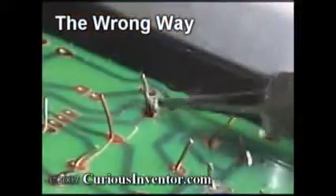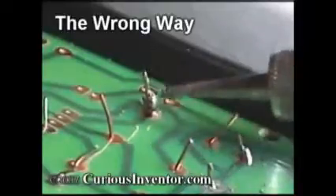Why isn't the solder clinging to the joint? Two reasons. Solder won't adhere to parts that aren't hot enough or parts that are covered with dirt or oxidation. In this case, I haven't effectively heated the parts enough for them to attract the solder.